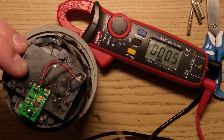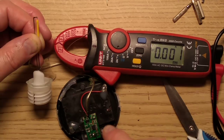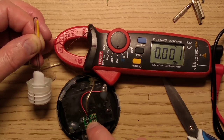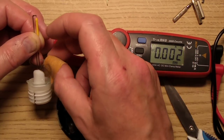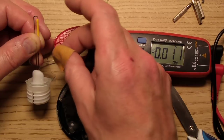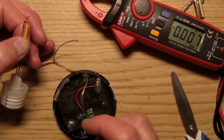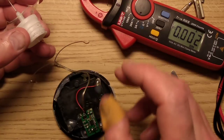There's a resistor — I'm going to probe this out. The unit is using a 430 ohm resistor, and it's switching it to the 3.3 volt rail. That means that despite the fact it's a parallel row of LEDs, the current the unit is drawing is only in the region of 11 or 12 milliamps. That's very low — really quite impressive because it looked okay. That means the batteries are going to last a good length of time, even if it's on for six hours at a time every night with its timer.